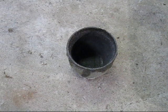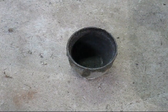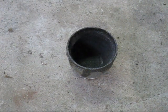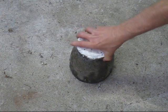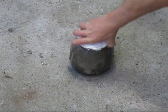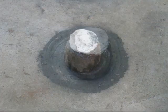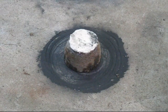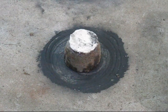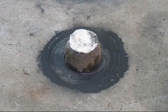Here is the simple solution to extend the life of the crucible. What I'll do is just flip it over and then rub that sharp edge on the concrete floor so it wears it away until the lip of the crucible is a lot thicker. That took about 10 minutes of hard rubbing and now we've worn down the lip of the crucible. I'll flip it over and do a close-up of the lip to see what it looks like.